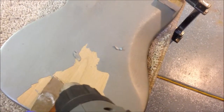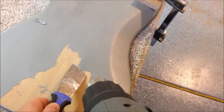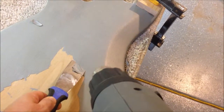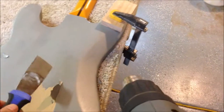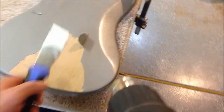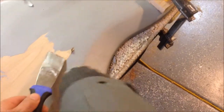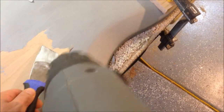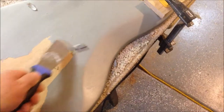This scraper is not necessarily that dull, so you've got to be careful about getting wood chips. You don't want to start scraping underneath a piece of wood grain — you've got to watch the direction of your grain as you're doing this, otherwise you might take a big chunk of your wood out. So always be very cautious. You can see it does peel off pretty good, but as soon as it starts to get a little rubbery, pull the heat away.